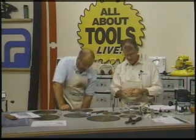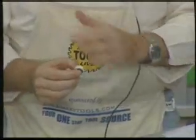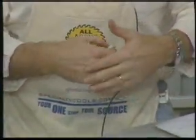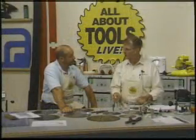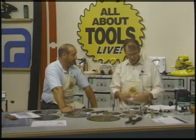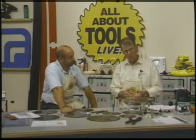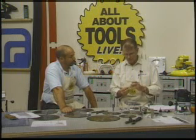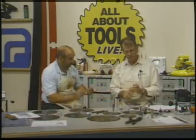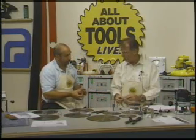But this nylon, I was fascinated to find out from the manufacturer, there's no guarantee on the performance life of the nylon on the bearing. It may last 3 inches, it may last 300 feet, it may last 3 miles. And the problem is there's so many variables to its failure. But that's something you want to pay very careful attention to. You want to make sure that it's always well lubricated and free moving. That is very, very important. But that also applies to a metal bearing.